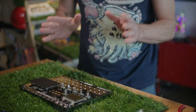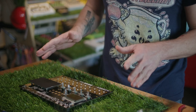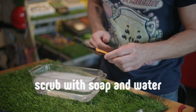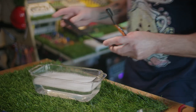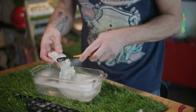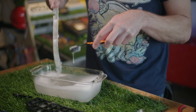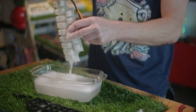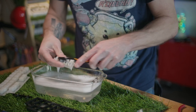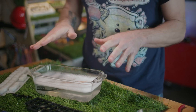The board is nice and clean. The next step is actually to clean the contacts on the rubber pads, and for this we're going to use soap and water. We have soap and water and a little toothbrush, and now we can gently soak and wash the rubber parts. Let me rinse this off, dry everything, and then we can assemble and test it.